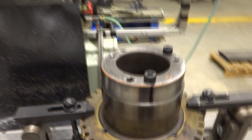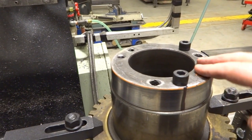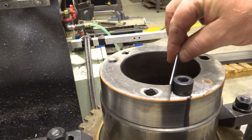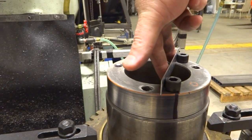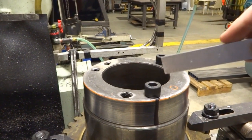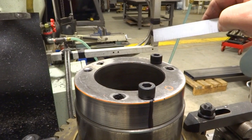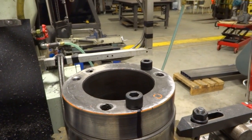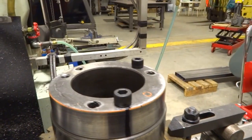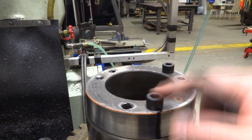The way it works is: I'll have these bolts in, take this end and set it on the milling machine table. It'll sit on this surface on the table, and the bolts will hang over the side of the table. I'll push them until they touch the edge. What that does is essentially make it so that a line drawn from the center of this hole to the center of that hole will be parallel to the travel of the table. From that I know where the holes are relative to one direction of table movement, and can figure out where to place the holes.